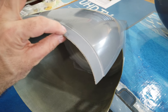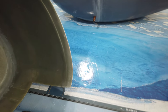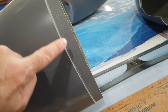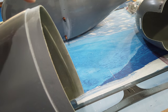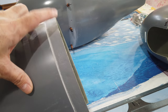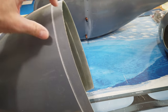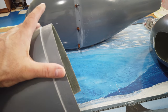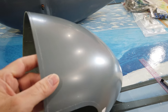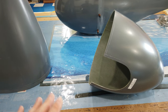I'll show you all this as I do it, but I want to give you some things to look for upfront. You don't want to sand this too much because this is what the nut plate attaches to and you want it to be nice and beefy. If you're trying to mate the front half to the back half, trying to file and sand this edge to fit to the front would be very difficult because the flange is in the way. So I don't do anything with this piece other than square up this corner and knock down the high spots on this flange face. Then I fit the front piece to it — a little at a time — and knock it down to get it to fit.